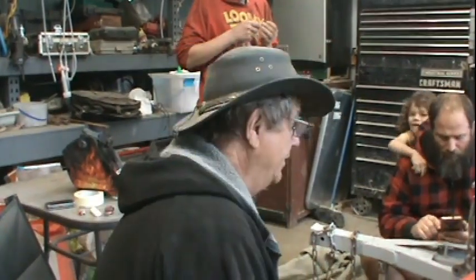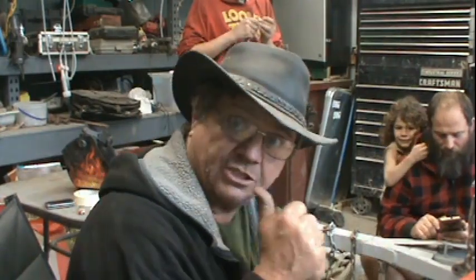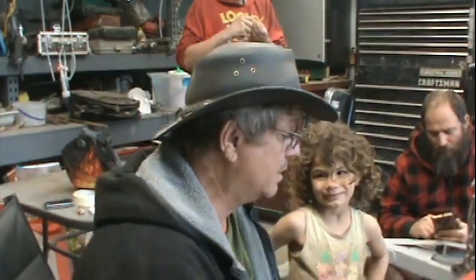Set of bearings, because of course we got new bearings with the new hub and a new seal. All of that for this side is golden. The old side, the side that didn't burn out, the bearings were like grinding rocks. So we had to replace those bearings and seal as well. That seal was gone too. And I don't want to have to do this again. So we're going to go ahead and put new bearings, new seals on the other side, pack everything.